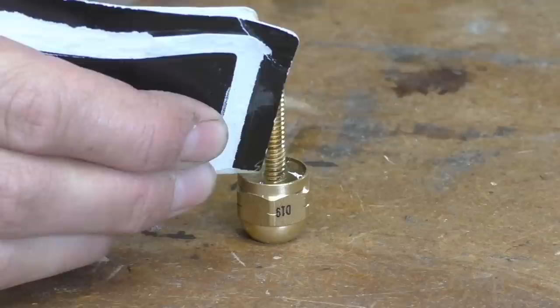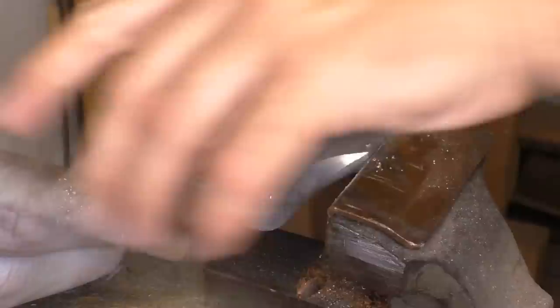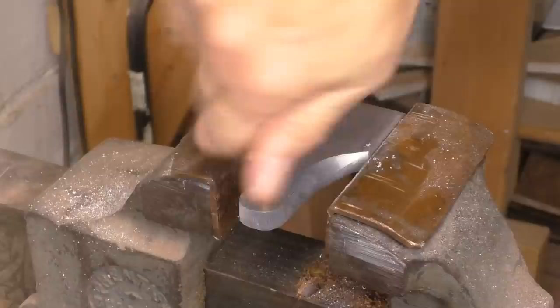Let it dry overnight and it'll be perfectly solid. The flat sides on the cap give you plenty of grip for tightening it down, and the epoxy holds up just fine — I did one of these a year ago and it's still rock-solid. I've got links to all the parts, materials, and tools for this build down in the description. Now I'll drill and tap the top of my lever cap, run in the screw to test it, and then drill and tap the sides for quarter-20 machine screws.